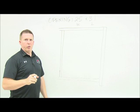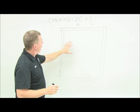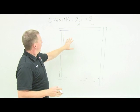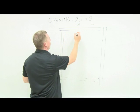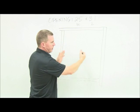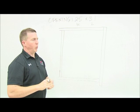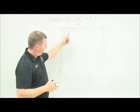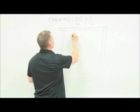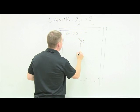Time to figure out the sizes for your doors. There are a couple of steps. First, how big is your opening? This represents just the right side of the cabinet I'm building, and I know it's 25 inches wide and 31 inches tall, inside to inside. When you're doing doors, just like a drawer, you want to add a half inch on both ends and both sides.